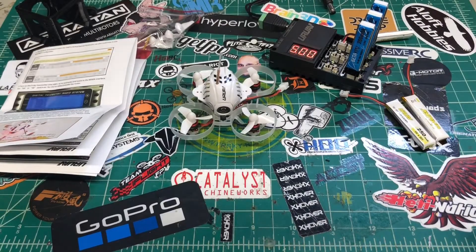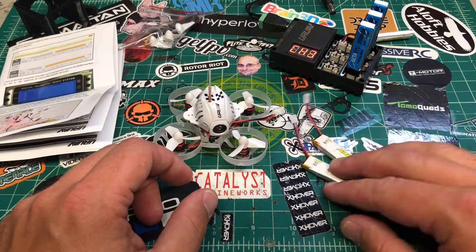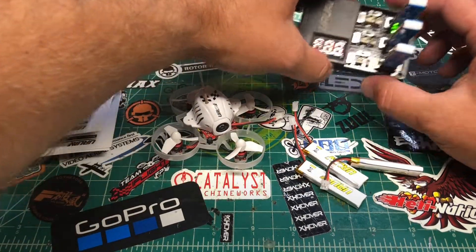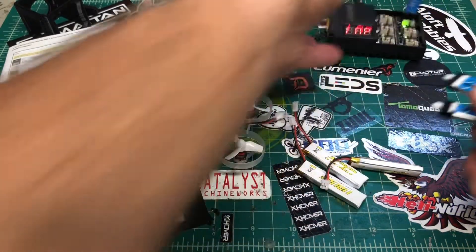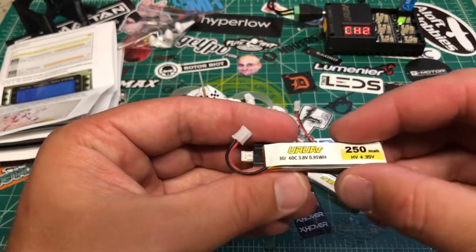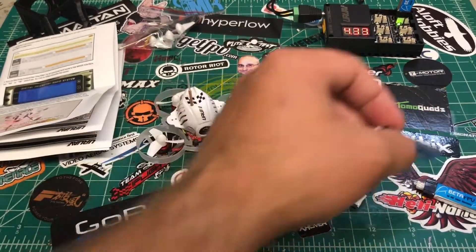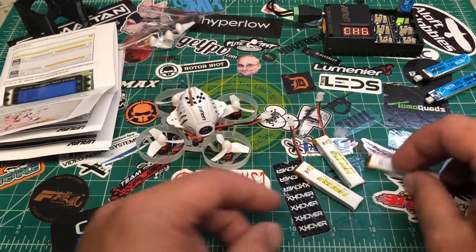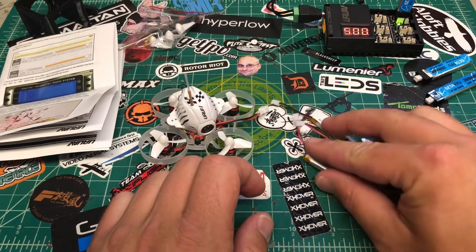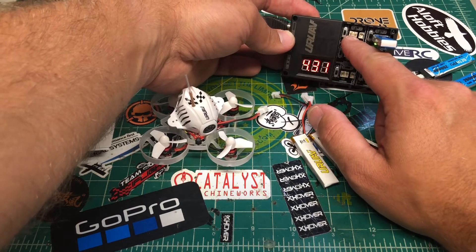You get the little drone, and one of the batteries was underneath. You get three of these batteries and a charger. These included batteries are standard 260mAh high-volt cells — pretty much the same size as my other whoop 250mAh high-volt batteries, so pre-existing whoop batteries should work. However, one of the included ones already has a little puffiness to it, so I don't think they're going to last very long.